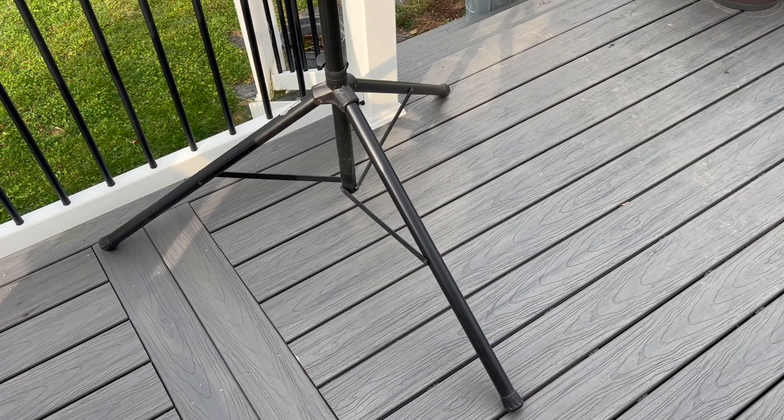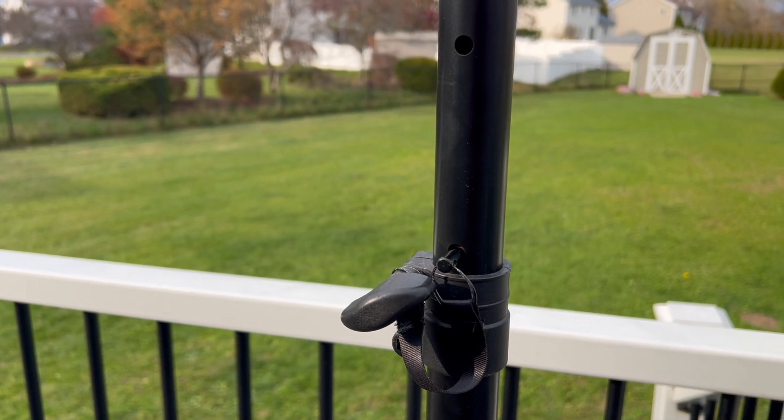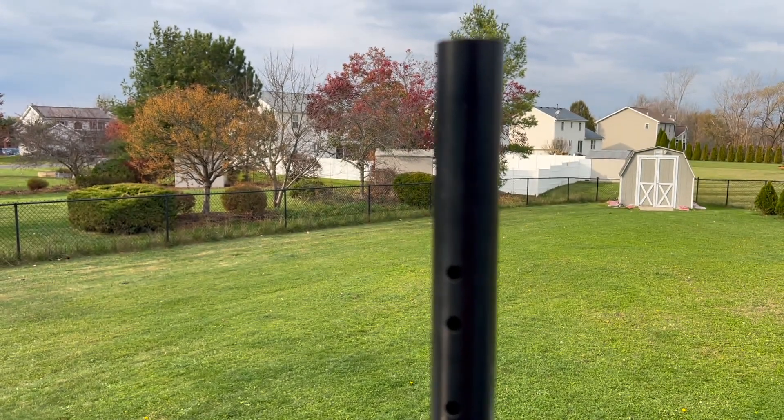Future Mike here. I finished the video the other day — or at least I thought I did — but I realized I never got around to using RG58 on the lightweight masts. Maybe I forgot in the heat of the moment, or maybe I chickened out after the POTA 20 collapsed on me. Regardless, I want to make sure this video has a happy ending. So let's do something a little different: instead of just hanging the antenna from the top, I'm going to set it up like I would in the field — spreading the legs of the off-center-fed dipole to disperse the weight rather than concentrating it all in the middle. I'm also going to use a speaker stand from Amazon as the base, which fits all three masts perfectly, and you can even fit a three-quarter-inch PVC in there too.